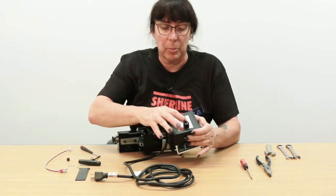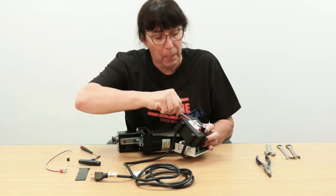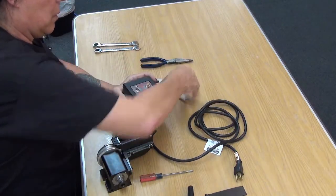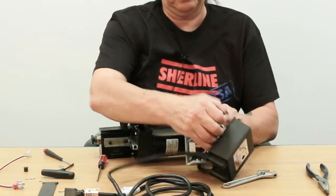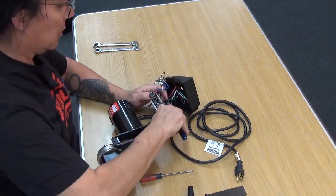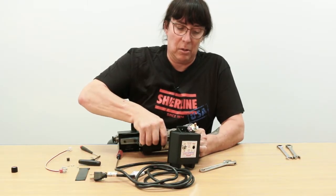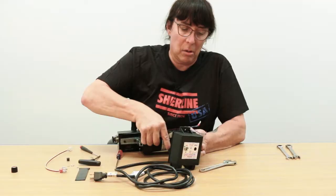Now what we're going to be removing is the potentiometer. With a flat blade screwdriver, there's a little screw in the side of the knob — loosen it and remove the knob, won't be needing that. Loosen the nut carefully and push it out. Now we have it out. Take your needle nose pliers and very, very carefully just wiggle them off. Hold onto it nice and tight and just wiggle them off so nothing gets broken or pulled apart.